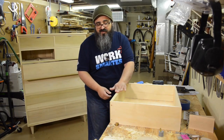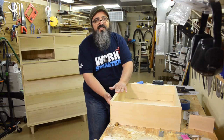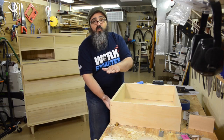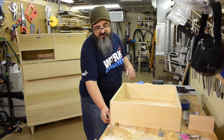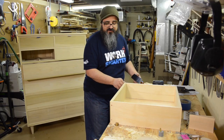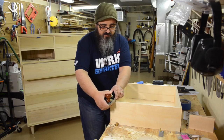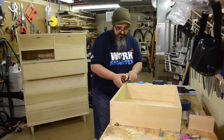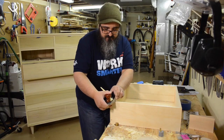I'm really going to concentrate on the top and the bottom — particularly the top. If you think about it, when the drawer is sitting in the opening, the bottom is kind of a fixed position. There's not a lot we can do about the bottom because it's always going to be in contact with the drawer frame. So we need to compensate as much as possible at the top. That's where it might look a little bit gappy. All I'm doing is coming in with my block plane and taking a couple of passes, being careful not to blow out the sides.